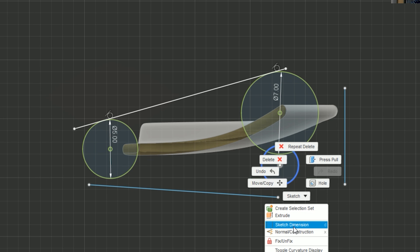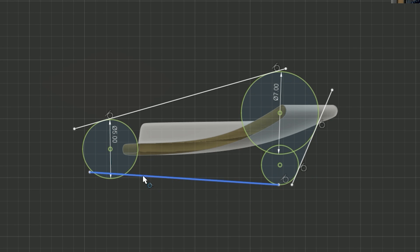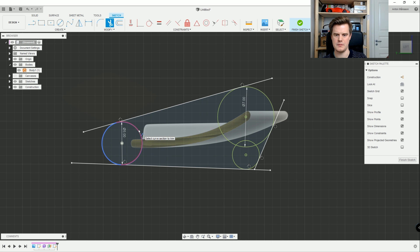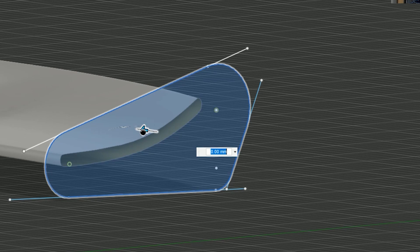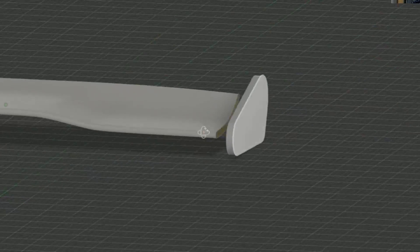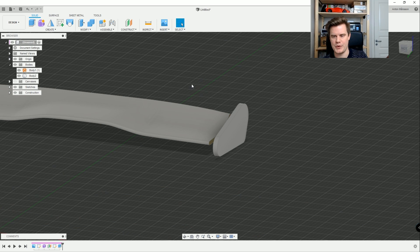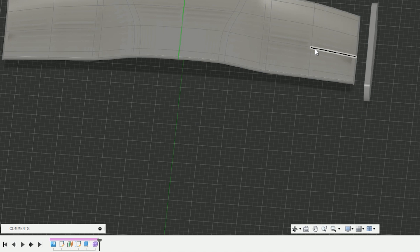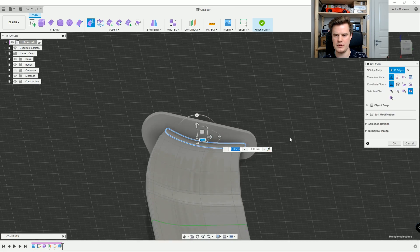The points should be fixed, then I'll make them tangent to that, and tangent to that. Let's add another circle down there, make some lines - they should also be fixed. Tangent to that one, tangent to that one, and so on. Now we have our profile and we can trim it. Once trimmed, if we extrude this at 1.2 millimeters we get the end plate, though they're still not connected. This was a quick way of doing parametric drawing. Also note: everything we do here happens before the form in the timeline, so I can still change the form and have this model update.